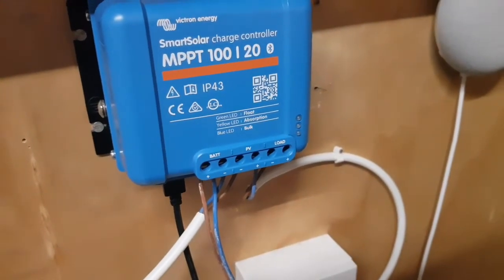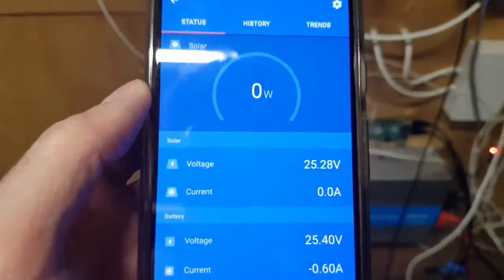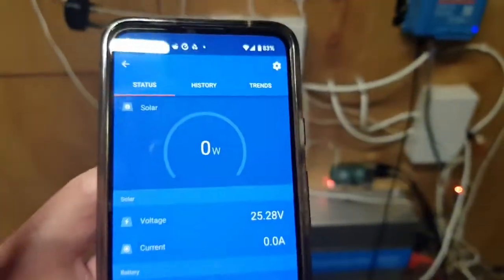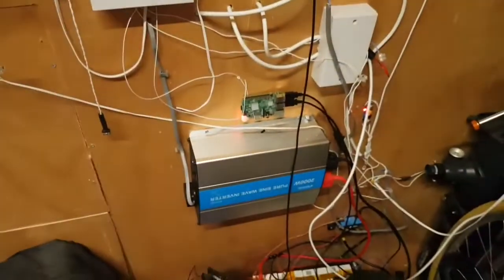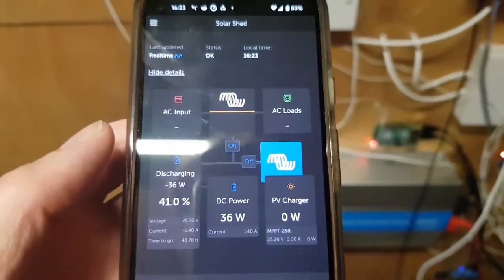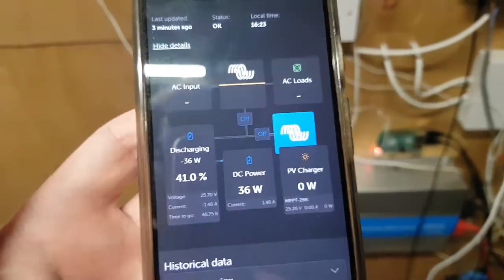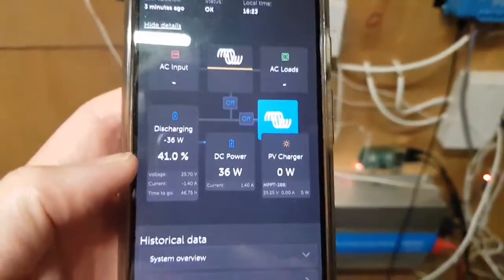Things are flashing on it, so I think that's working. Battery Life mode is apparently meant for lead acid batteries — you don't need it for lithium iron phosphate normally, because you can keep these at a low state of charge and nothing bad happens. But with lead acid you want to charge up at least once a week. So what this will try to do is get it to a state where it can charge up once a week by turning off the loads. I'm going to see if it keeps the state of charge higher — I'm looking for these dips around 40% to be higher now. The weather in November is crap and we're heading into December with the shortest day coming up, so solar is going to remain low. I'll have to report back to see if the state of charge stays up higher.